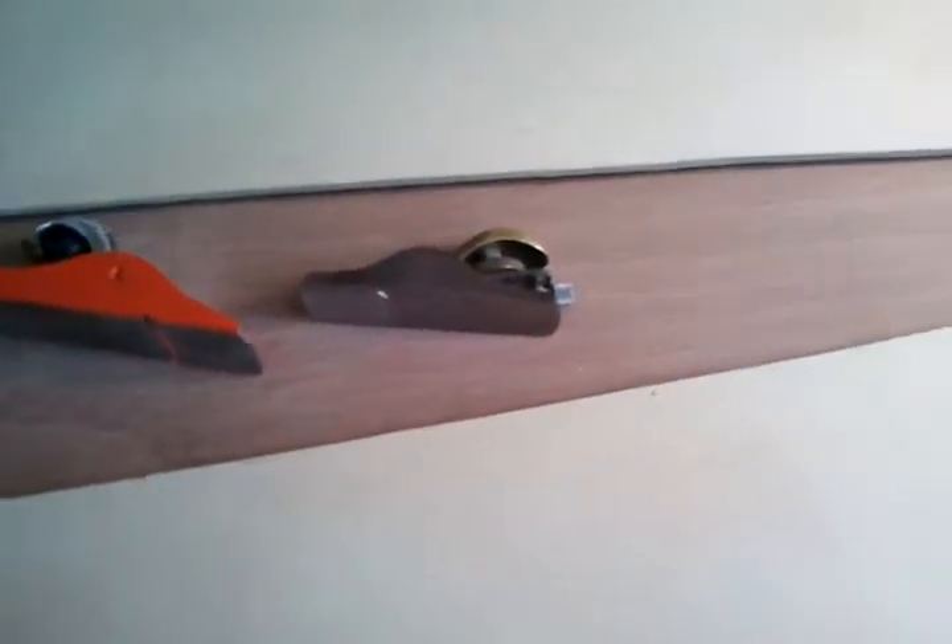The process is: measure out and draw the bevel on it, then block plane it to within an inch — or half a millimetre — of its life. Then take the Lie-Nielsen and get it down to within really a tenth of a millimetre or something, some really close amount. You can see if you're basically following the smoothness of the plies in the wood, making sure that they're nice and evenly cut away. As that comes to a blunter angle up the top, that's pretty well there.